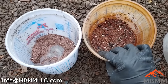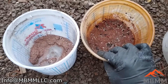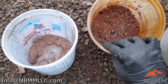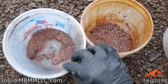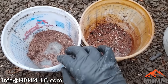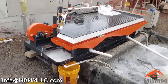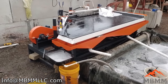80 pounds of copper at $3.54 a pound is about $280 to $320 a ton. So that probably is worth going after at the current prices, and you can run it really pretty fast on the table. This is stuff right out of the granulator — you can get rid of your static separator, you can get rid of your screens, get it wet, put a little soap in with a mixer, and then run it right on a shaker table just like this one and get another several hundred dollars out of your tailings.